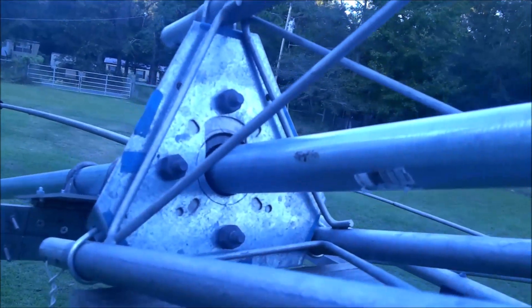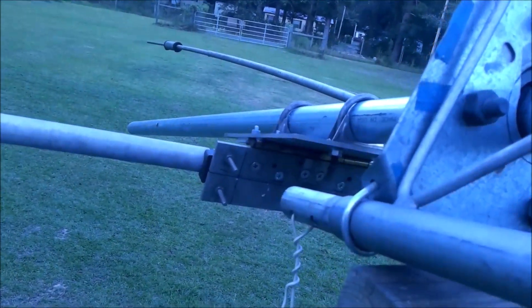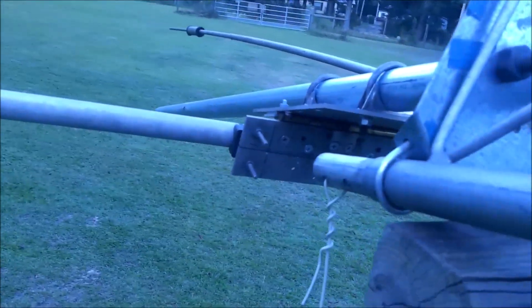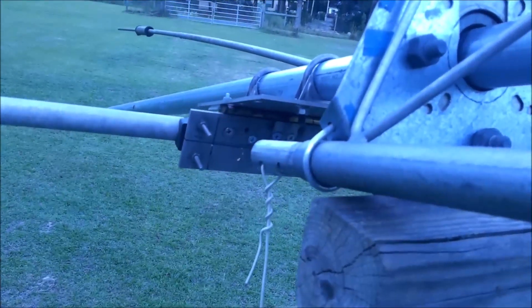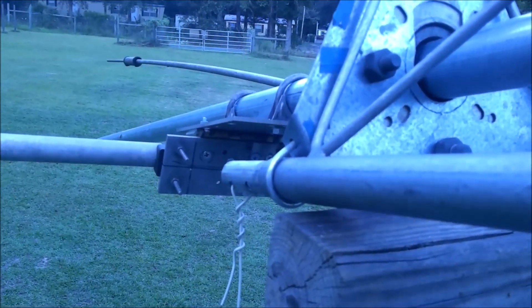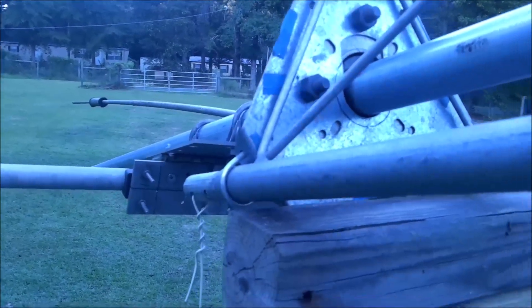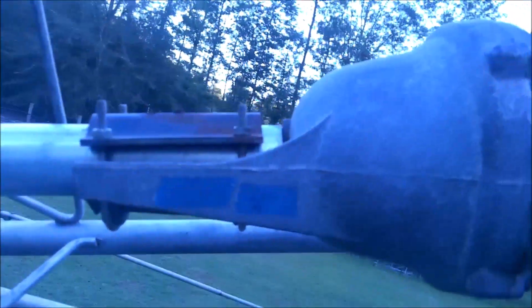Here's the rotor mounted on a rotor plate, going down through the thrust bearing and out the top of the tower with the Yagi. It's on its fold-over plate, so it's parallel to the ground rather than having the elements stabbing into the ground.